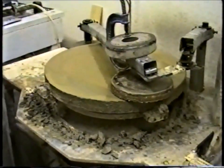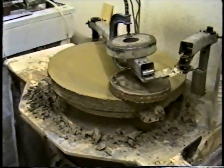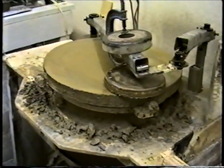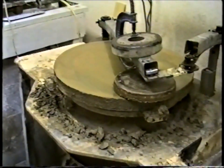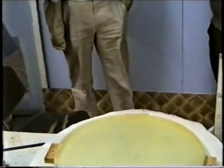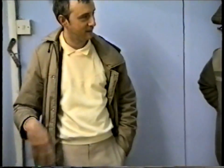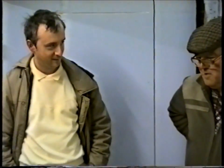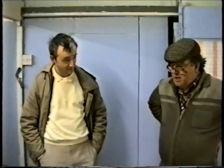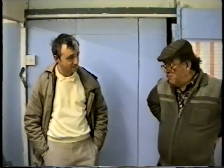Yes, but a couple of thousandths is very, very crude indeed, because you want it to go down to fractions of a hundredth of a thousandth. So it is really pretty crude. Presumably there's a time when you built your first grinding machine. Did it just work like magic from day one, or is there a black art? There's certainly a black art in polishing and figuring. Grinding is relatively simple, actually - it's a relatively crude process.